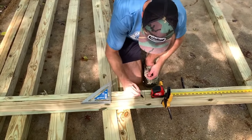And this is an important step to make sure that all your framing nails that go through the plywood roof sheathing hit a roof rafter. All right, so at this point you can see I have all the lines. Now it's time to nail them all in. I simply took my framing nailer and every 12 inches on center, I attached the plywood roof sheathing to the roof rafters below. And this was easy to do since I had the chalk lines that showed exactly where the roof rafters were. Repeat this process across the entire roof, making sure that you secure all the sheets of plywood to the roof rafters every 12 inches on center. You may need to angle some of your nails to make sure that it contacts a roof rafter appropriately. And at this point, we've successfully completed our lean-to shed roof framing and the decking installation.